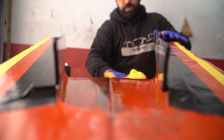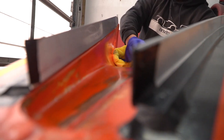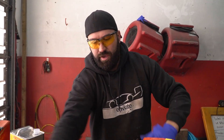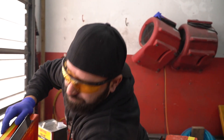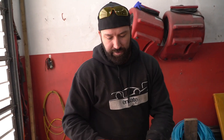The good news is this is a pretty easy part to pop. It's actually a two-piece mold — you can see the seam down the middle. There is a little bit of draft angle right here. The last time I did this, the only part I made on car one, I was pulling on the PVA and it just popped right out — didn't even need to be a two-piece mold. This tape and the marker line is there to have an untreated area, so the bag tape will not stick to the mold after it's been prepped with the pre-coat. I used a marker to mark where this tape was and I now stick the white tape on.